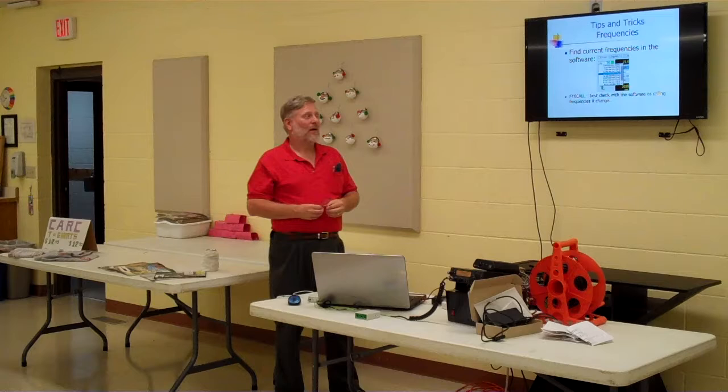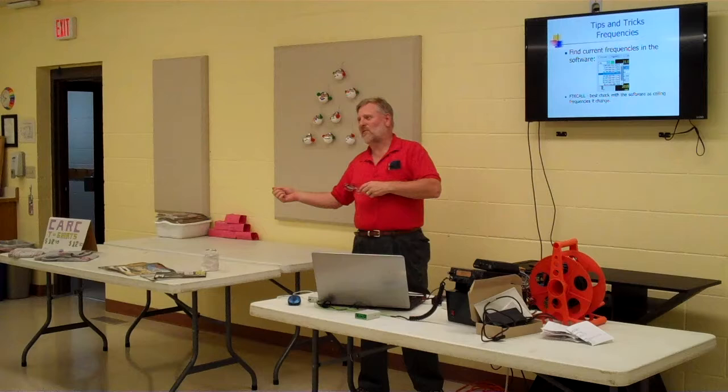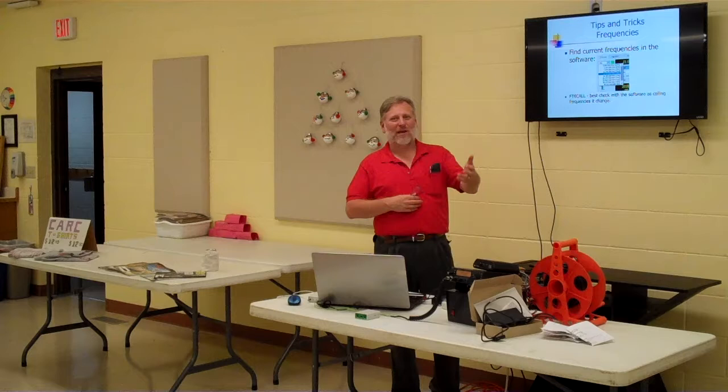The new one, FT8 call, where you can actually make QSOs between each other, actually do chatting, they're in flux because they're having a battle of, well, if we put them on here, then we interfere with the FT8 guys, and the FT8 guys are interfering with us, so they're going to be a couple of kilohertz off somewhere. And they're still in flux. Even last week, they were talking about moving 40 meters out a few kilohertz or whatever, not playing with the RTTY guys, and not playing with the PSK guys. So it's best to check with the software, because it's still all looking around yet.